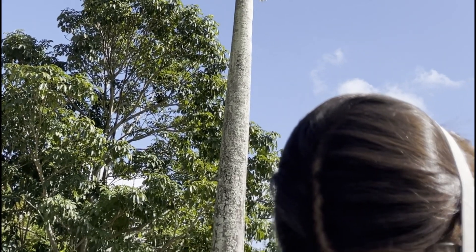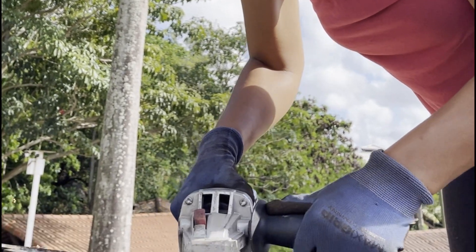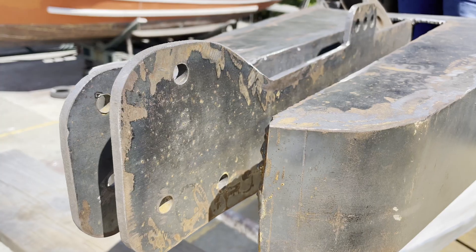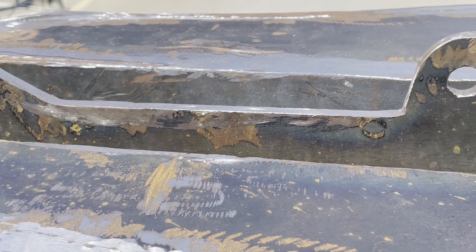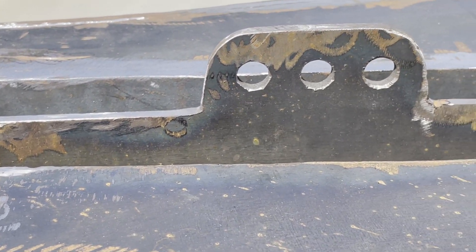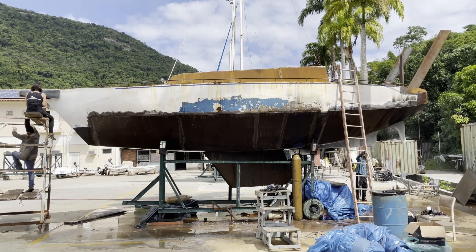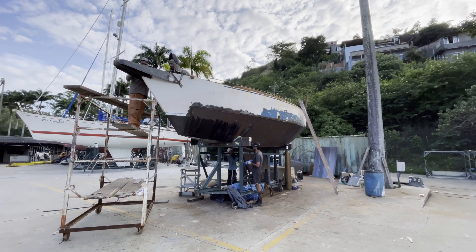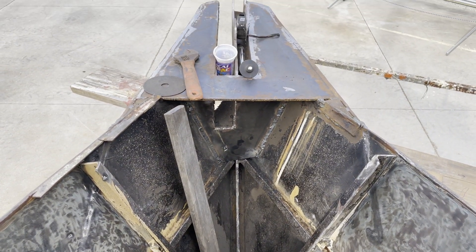To eliminate all the crude edges and give it a more machine-like look, we took the time to sand it smooth with an angle grinder and fix any imperfections. Since the slope of the hull was hard to predict, we applied the finishing once the bowsprit was in place, extending the sides to follow the flow of the boat and create a continuous appearance. Then we kept rolling, closing off the front of the bow and diving into the chain locker.